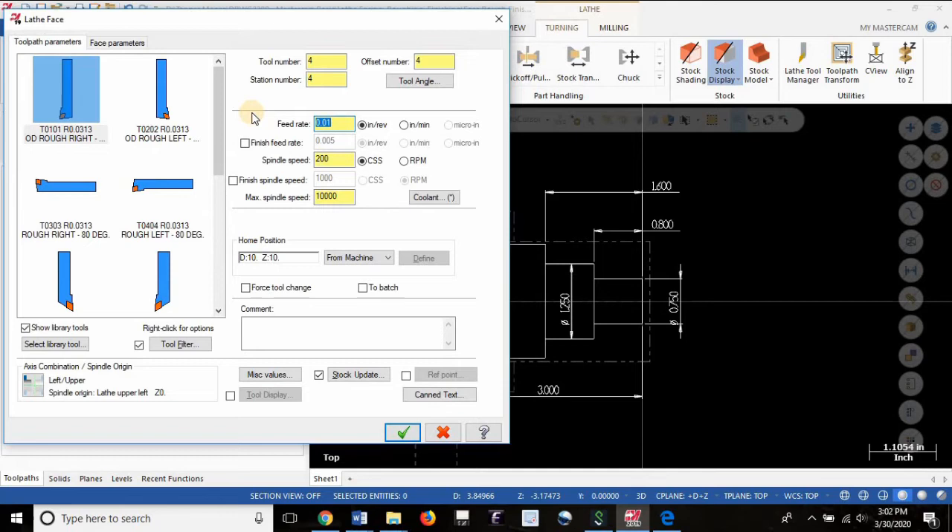We need to decide on a feed rate in thousandths per revolution. For a facing operation, you might want to go with something like .007 to get a good surface finish and also not apply too much pressure when feeding in X. For spindle speed, if we're using a carbide insert tool, maybe somewhere around 350 is a good place to start — you can experiment with these numbers. Setting a max spindle speed must be done with safety in mind: when you grip a workpiece and spin the chuck, centrifugal force causes the jaws to want to separate, reducing gripping pressure. So cap your spindle limit — somewhere around 2,000 for general application — to stay safe as the cutter approaches X0 and spindle speed increases while maintaining cutting speed.